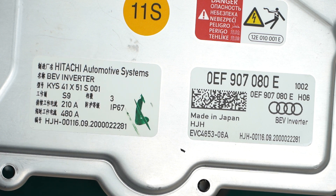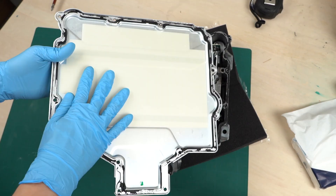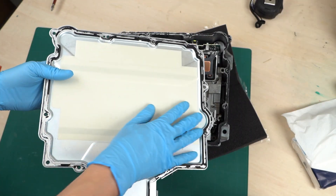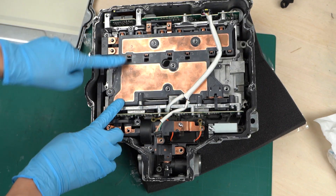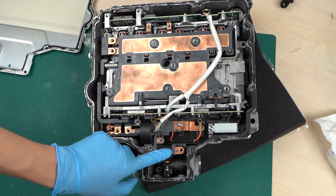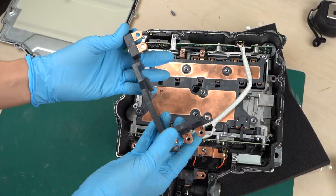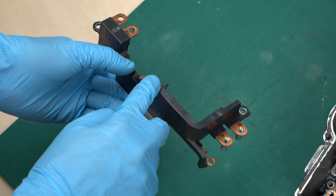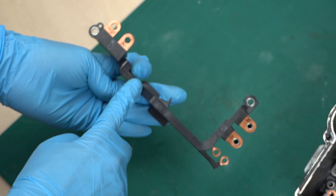Let's remove the lid. The lid is made of aluminum. A resin insulation sheet is attached to the back of the lid for insulation. When you open the lid, you can see copper bus bars. These bus bars are connected to the DC input. The first bus bar is laminated with resin — inside, two bus bars run alongside each other. This type is called laminated bus bars, and they minimize the inductance of bus bars.